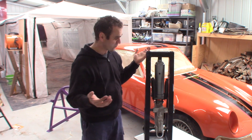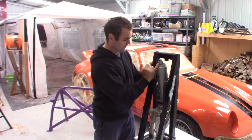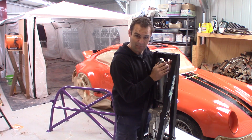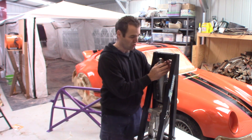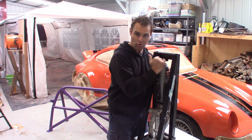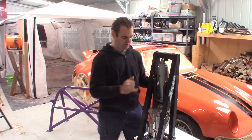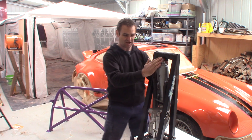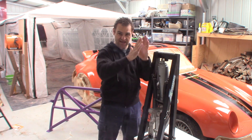As for the mounting cuff, which the neck of the ram from your bottle jack sits into, I've doubled it up — I've got two pieces of pipe inside each other, welded together to make that extra strong. Because that's taking the full brunt of the force of the bottle jack from the shoulder of the bottle jack pushing up into the bender itself. Another thing to note is that when this is pushing down as the bender moves, it actually pivots slightly on this point, so it does pivot as it's pushing down.